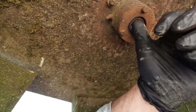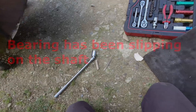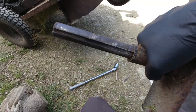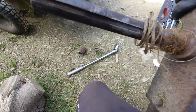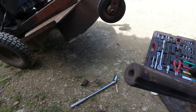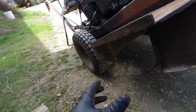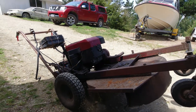Yeah, that bearing is pretty worn out. Oh, it's actually got a grease nipple in there. I'll pull those bearings out and replace them. I think I'll just have to weld the shaft up and machine it down again — the only problem is my lathe is too small for that, so it would be a matter of building it up and then filing it down to where it should be. That's a job for another day, but it's definitely worth doing. That grass deflector also needs to be pulled out and welded — I think that's why the grass was getting caught up, it's been bent and broken. Anyway, I'll leave it there for today and come back to it. Thanks for watching — see you next time.